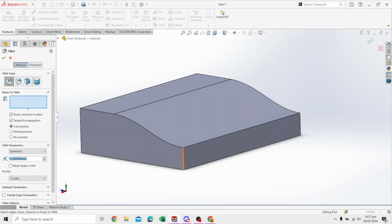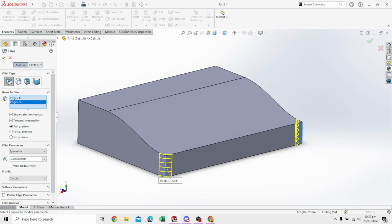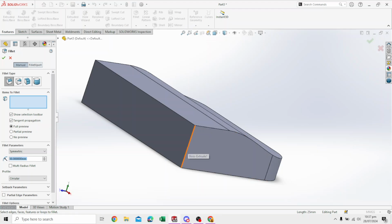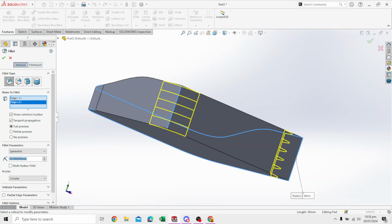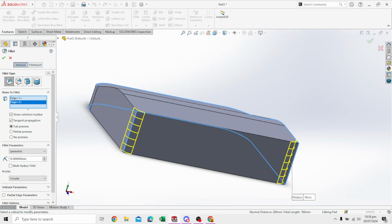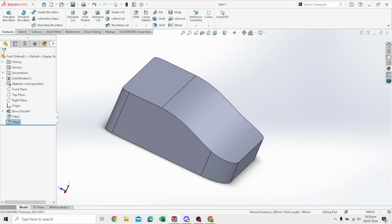So we select the fillet command and fillet this corner, as well as this corner, by 30 millimeters. Yep, what we need. And we also do the same to this corner as well as this corner. The second, wrong corner. Select the face, not the corner. Select the face, and we do this by 10 millimeters, not 100. And okay, this is what we need. Say okay. This is what it's starting to look like, the bottom, the base of the fan.